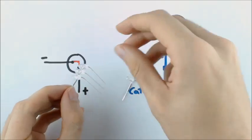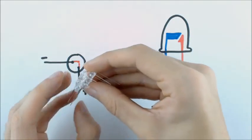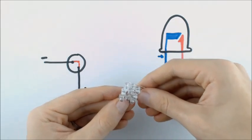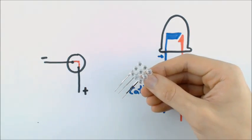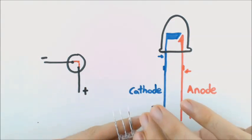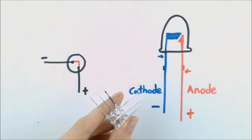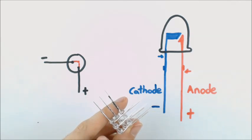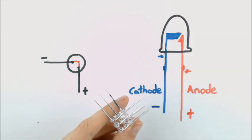Now, what you need to do with these is connect the anodes with one another. And so we'll have our cathodes pointing out that we've already connected, but then our anodes underneath will each be connected in rows as well. Just make sure that when you're doing this that you don't see any connections between your anodes and cathodes. Those should be separate all the time.